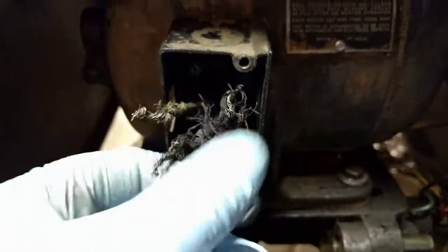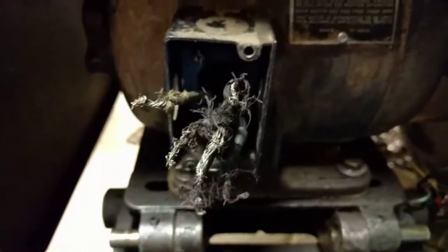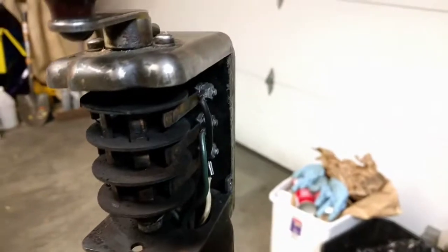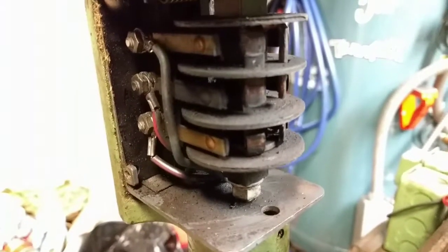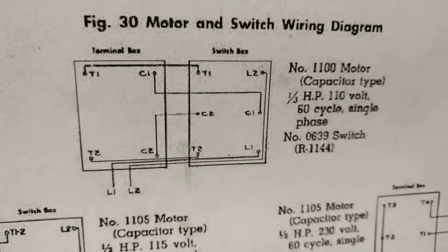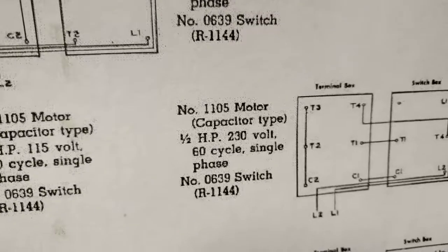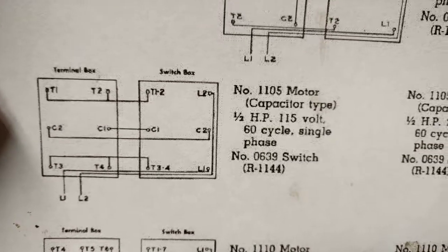This was actually wired for 240 and I was running it on 120, so it wasn't quite optimal, but I'll put it back together the way it's supposed to be. Here's the switch that has six wires coming to it from the motor area — it's pretty straightforward on how you wire this based on their wiring diagram, which I'll show next. Here's the wiring diagram that comes with this lathe showing various ways to wire it: third horsepower 110, half horsepower 115 single phase, or 230 single phase, which is what I wired it as.